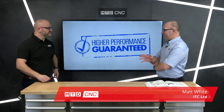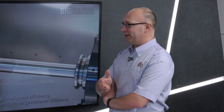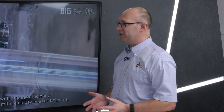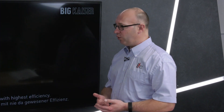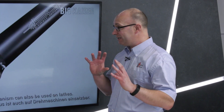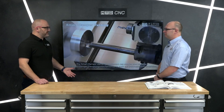Let's take it simply. I did an application yesterday — it was a 12mm boring bar, nearly five times D, and the biggest problem I had was chatter. Just on that classic five times D, no longer, you're going to have problems with chatter. This isn't pushed as a superstar for Kaiser — usually it's the boring heads with the Big Plus spindle tooling — but this is a really important addition to the Big Kaiser range. If you've got a deep hole, a deep bore, and chatter is an issue, the Smart Damper comes in as an anti-vibration system that takes the chatter out of the equation.